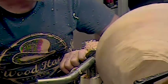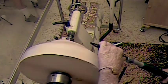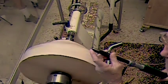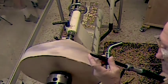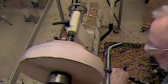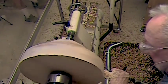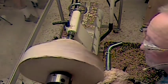And here, when you're cutting like this, directional control isn't by swinging the handle, it's rotation. The bevel is rubbing, you want to dive in, you rotate a little, you want to come out, you rotate a little. Just all in tiny rotations. I'll show you. So here I'm going, and I twist a little bit, and then dive again, and I twist a little bit back, and I'm coming out.